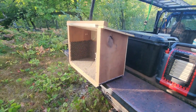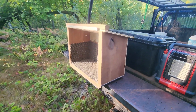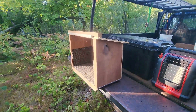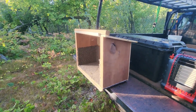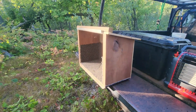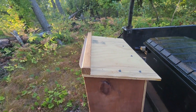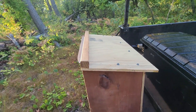The sides are basically made out of end pieces of 2x12 that I use for deck stringers. These are 16 inches long on the high side, 14 inches long on the short side, and about 11 and a half inches wide — your basic 2x12. It's brown treated material; probably doesn't have to be, but that's what I had lying around. The top is just half-inch treated plywood. One could maybe wrap that with metal, but I figured treated plywood lasting 20 to 30 years is good enough.